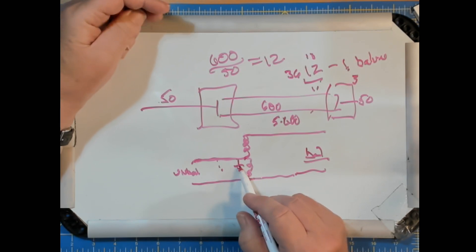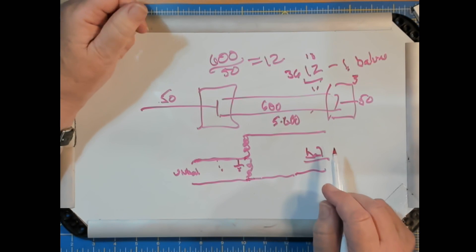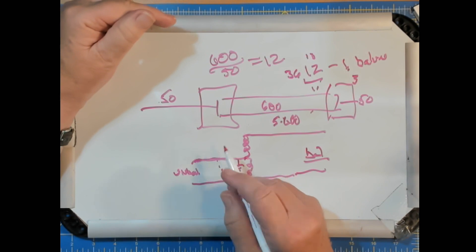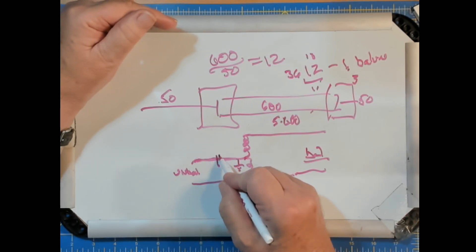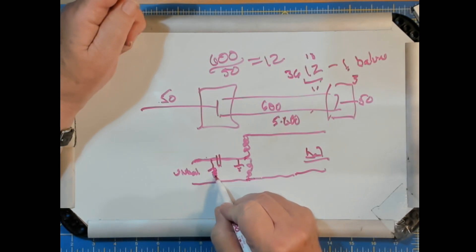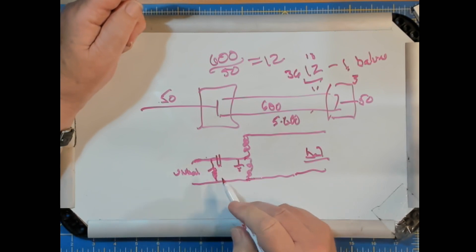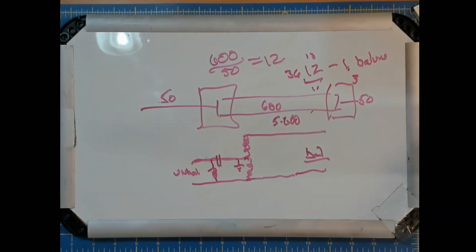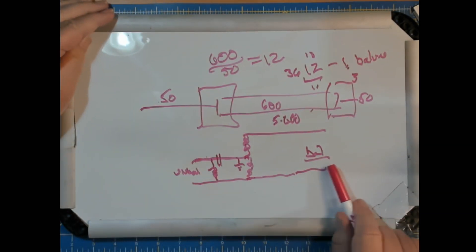You've got two things you can do. You can run a control cable all the way up to where you have the relay, or you can put in — and you'd have to experiment with some values — a fairly large capacitor right here and then a choke, connected so that this will give you your DC ground. Then you do the reverse at the other end. I think you might be better off running separate control cables for the coax switch. They may have to be a little bigger than the usual number 18 wire to cover five or six hundred feet.